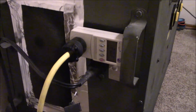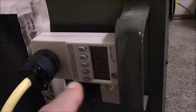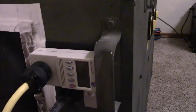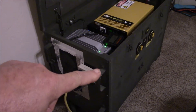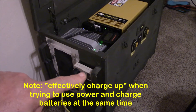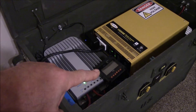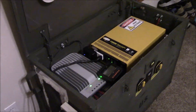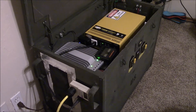I've got about 4.8 kilowatt-hours in the batteries. I hooked up the kilowatt meter to the air conditioner to see how many kilowatt-hours I pull in one cooling day. If I go all the way down and use all 4.8 kilowatt-hours of battery, there's no way I can charge and run simultaneously. It'll still charge — I'm getting about 750 watts off the 1000-watt array, and the air conditioner uses around 500 watts when the compressor is on — but it'll take a lot longer.